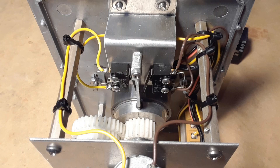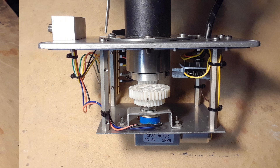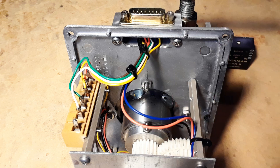This is a view of the azimuth drive end-stop microswitches. The motor is wired up to them, and from that goes out to the connector for connection to the outside world. The azimuth positioning potentiometer is wired up to the rest of the harness, and everything goes back up to the milled-out block where the DB15 connector is. This is where it all feeds out to the control circuitry and the sat-track box.